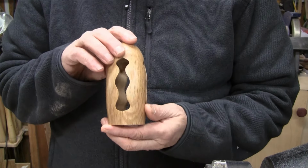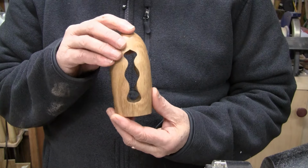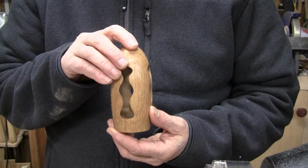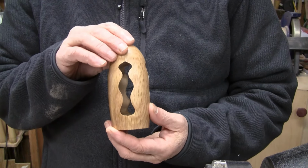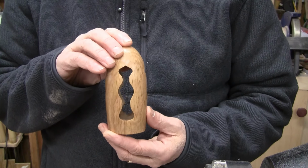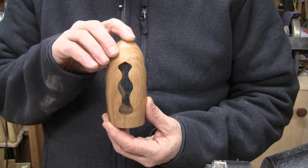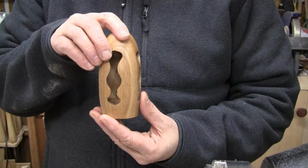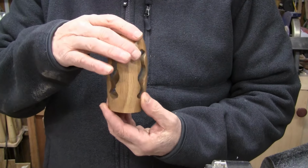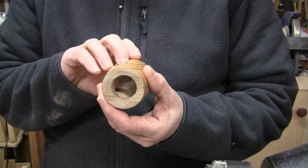That stems from my occupation as a wood pattern maker. When I would make patterns for pumps and the volute section, we were given drawings of the cross section every so many degrees. Each side of that block, I would lay it out, saw it, and sand it right to the line, and then take a spokeshave and carve in between, and that's how you create a volute for a pump. Anyways, I thought I'd try it here, and it worked perfect. I wouldn't say you'd have to do it on this, but if you wanted to make it easy, you could give it a try.